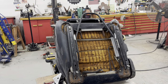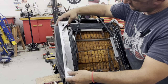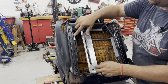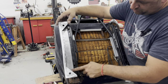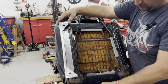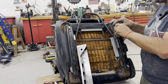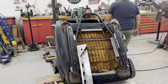I've got the seat flipped up here and I'm going to get these risers positioned. I made them just exactly where I don't really have to do a lot of guessing as far as where they belong. I'll pull these bolts out of here — I've got two separate holes. This one's a little oblong, so I'm probably going to choose the inner hole because it gives me a little more meat. This hole is pretty close to the end and I just feel like I need to bring it in a little bit further. I'll put some temporary quarter-twenties in there.